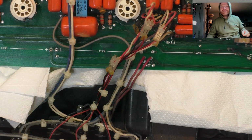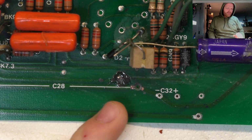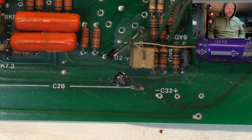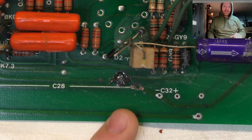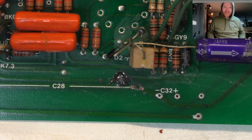So that's lovely too. It's really interesting. Everywhere that this contamination has occurred, the solder looks like it's still solder, but it's got a pale grey look to it. And then you heat it up, and it's hard as a rock, won't melt. And then this dark grey, sort of charcoal-looking splooge comes out of the solder and smells like vomit.